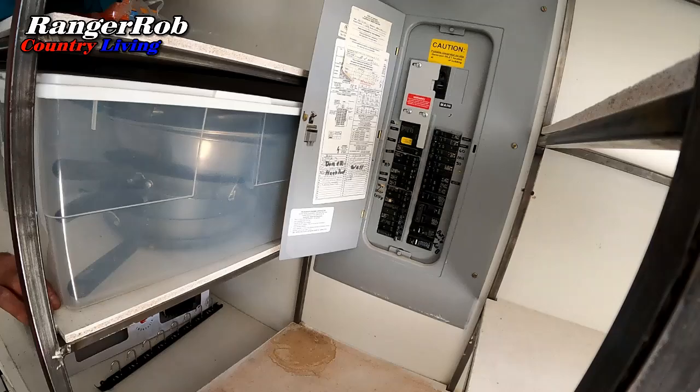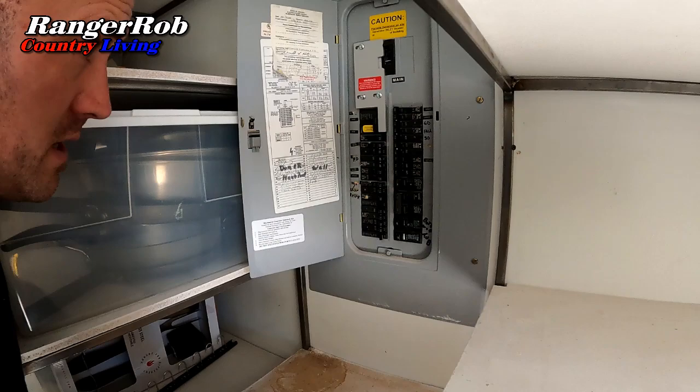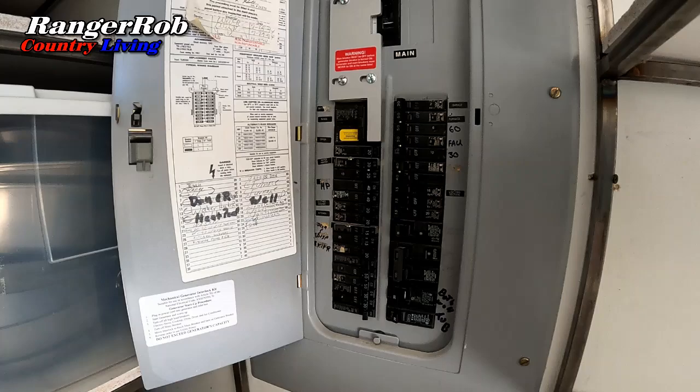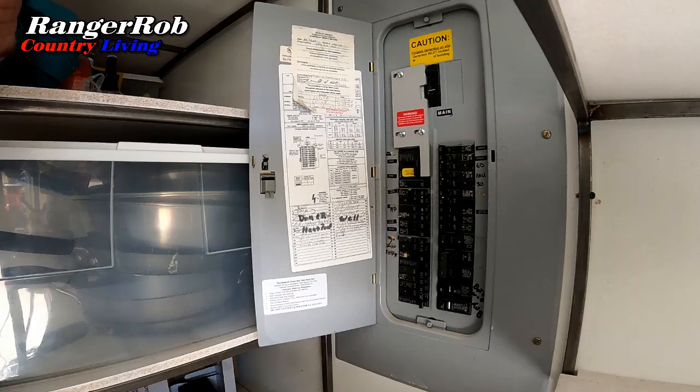You can live on it. If you're not running electric heat, you could do your water heater and some lighting loads. If you need to run your dryer and some other things, you could flip off the water heater and shed that load for a little bit. Obviously you don't want to leave the water heater off too long in the winter because you could potentially freeze, but that would take quite some time. When you're just living day to day, you should be able to pretty much live normally. It's just when you start cooking or running your bigger appliances that you need to start shedding load.